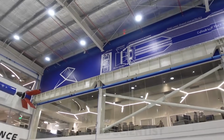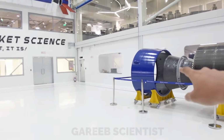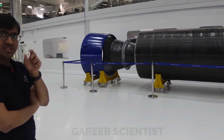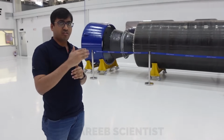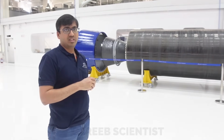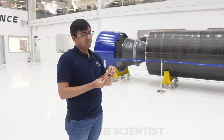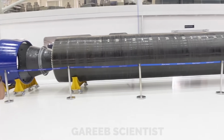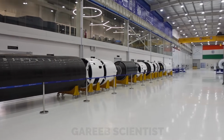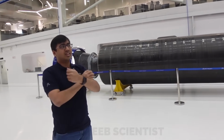So you said these are not fins, right? Those are not fins. We have sensors which identify that the rocket lifted off. They are called last minute pull or last minute plug, LMPs. They are electrical connectors which, after the rocket moves by maybe 5 mm or 10 mm, detach, and then you know that the actual liftoff of the rocket happened, and then you start the control of the vehicle.